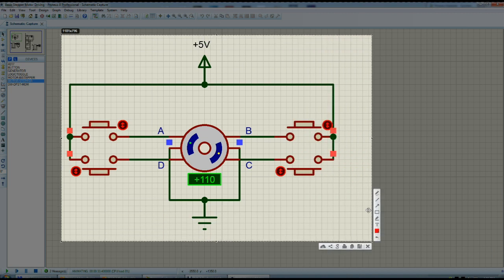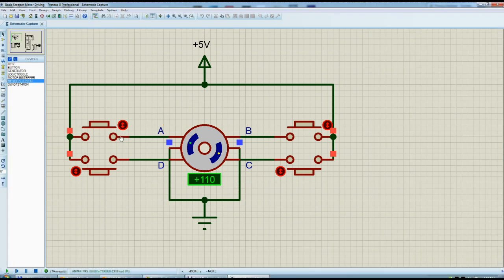Let me make a little diagram. The sense of the motor is that you press A to B to C to D, then back to A, then B, C, D, and back to A — and so on. If I press this, it will rotate inverse. If I press out of order, it will mess up and reset itself — it's not good to press out of order. If you keep the order, it will get to 360 degrees. At 360, it's actually back to zero, and then it steps to the next position.